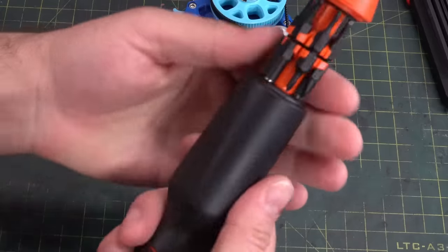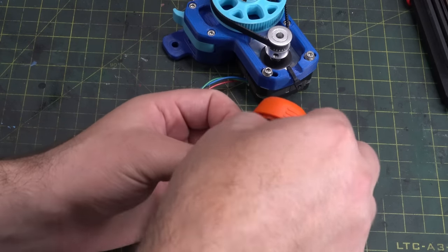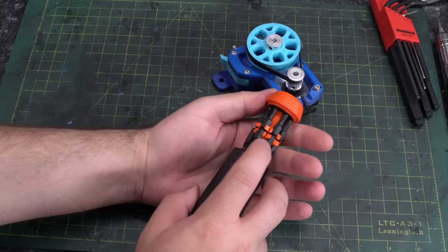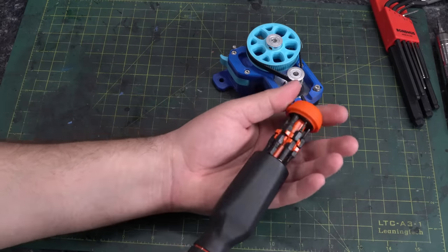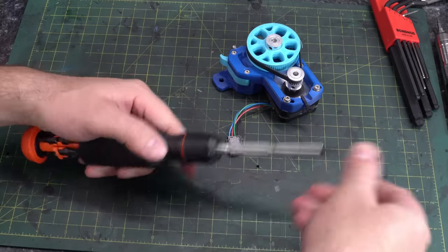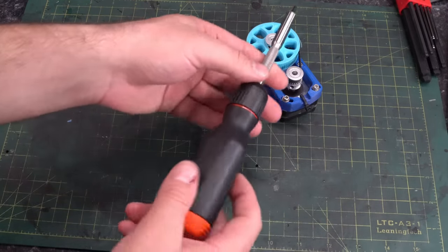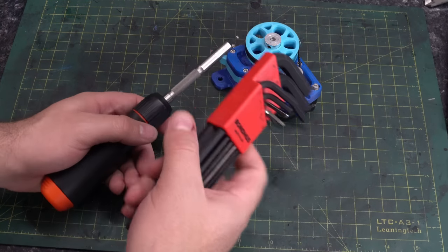With the bits, I went and bought the extra metric bit set, so I have this set up for building 3D printers essentially. Up top I've got metric bits all the way down to what would allow me to fasten M2 socket head screws, and I believe all the way up to the H5 bit. I also have two Phillips drivers and a flat head — mostly for terminals on power supplies and controller boards. The magnet is nice for storing everything in the screwdriver itself, and with Allen keys I have a tendency to misplace them constantly. With this, I've managed to not lose anything yet. It is a little annoying because it is a full-size screwdriver, so getting it into certain positions with smaller builds doesn't really work out — you still have to keep your Allen keys on hand.